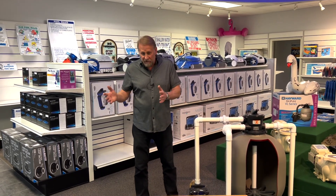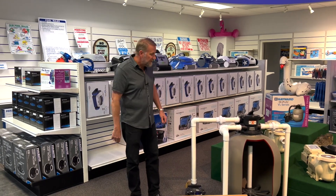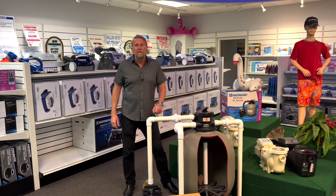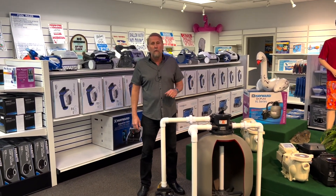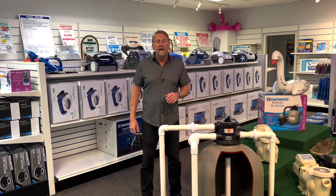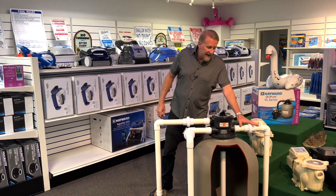What is a pressure leak? If you remember from part one, pressure leaks are leaks in pools that happen to leak more when the system is on as opposed to when it's off. The first thing we want to check is water leaking out of your backwash. When a pool is running in filter and it's leaking out of the backwash, it's obviously under pressure and you can lose water. It is classified as a pressure leak and is one of the more common leaks.